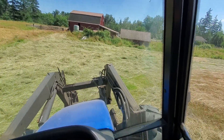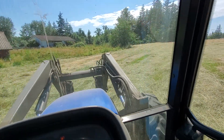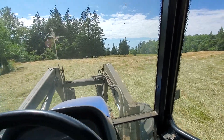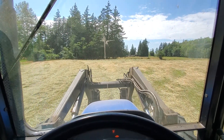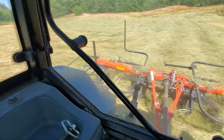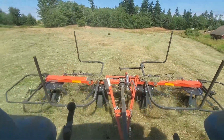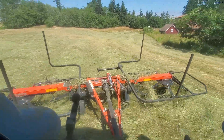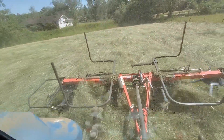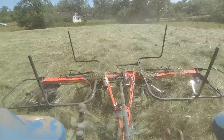A buddy of mine - for you John Deere fans you're gonna like this - he's got an old 260 mower, probably from the early to mid 2000s, and his mower doesn't have a problem with red top. Another buddy of mine, Kyle, he has a New Holland - I believe it's a 316 mower - a 16-foot mower conditioner, and his mower hates red top. Same exact thing, it clogs like crazy, he's gotta go super slow. I've tried speeding up to get the grass to flow through better, and I've tried slowing down. Slowing down seems to be the only thing that helps. When I speed up it just clogs faster.